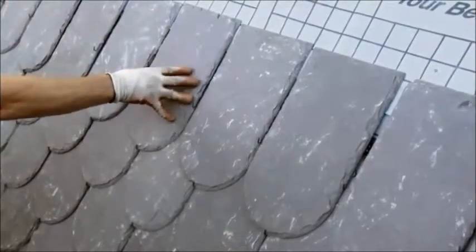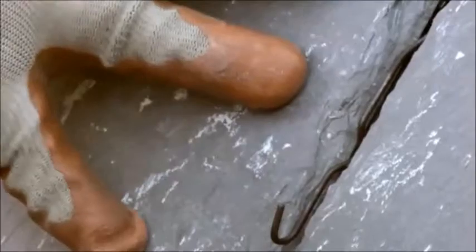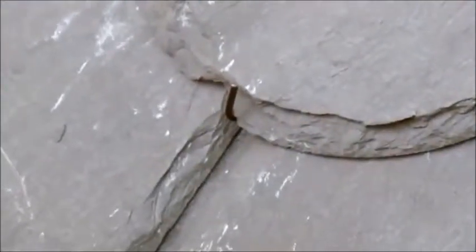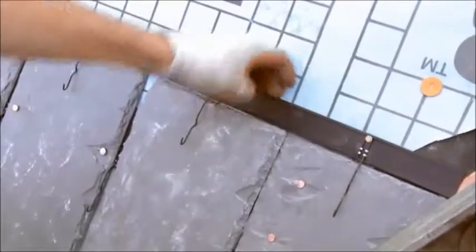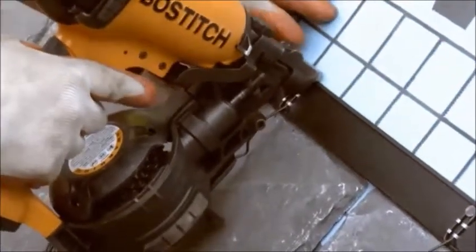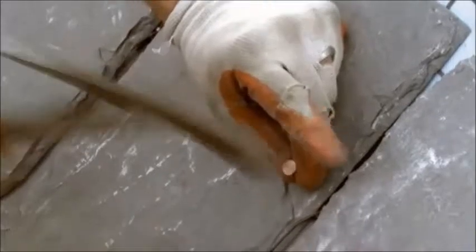When a slate can move freely, unrestricted by nails, it's impossible for there to be a mechanic error. In any roofing system, mechanic error is the leading cause of failure. You eliminate that variable. With this system, every slate is hung from a hook, and every hook is mechanically attached directly to the roof deck, eliminating the possibility of over or under nailing. That's the beauty of Qwik Slate, because let's face it, when a mechanic is installing slate all day and overnails a slate, the chance of him pulling it back up is pretty slim. And that's where your breakage is going to come over the winter.